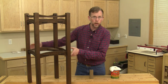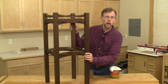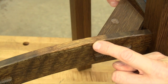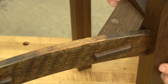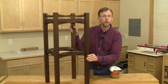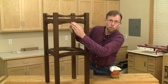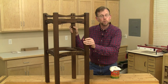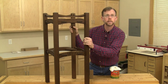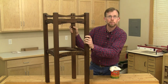There is something I learned the hard way on this project. Fuming colors sapwood and heartwood differently — look how much lighter the sapwood is from the heartwood. It's also important to use the same board for similar parts. On this project, I used the same board for the aprons and rails, and a different board for the legs, but the same board for all four legs. That gave me consistency where it mattered most, with similar types of parts.